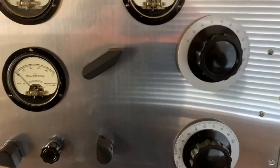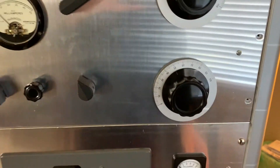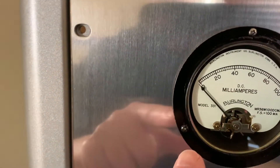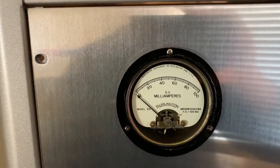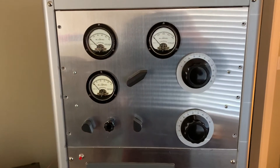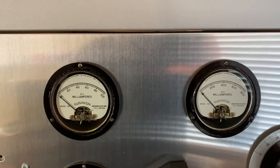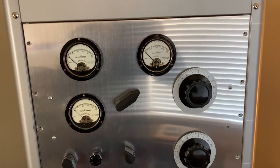I did correct the loading. Now on the first position on 40 it's somewhere close to the center of the range, which is the way I had it before. When I get on 75 and transmit I'm getting a full 400 watts, but the screen current is too high — it starts out on the left side of zero, so it's probably at least 40 mils. The max screen current I think is 60 mils, maybe 40 — I need to check the datasheet. The plate current at the dip is too low, and years ago when I used to load this thing I could get it above 330 mils. I don't know what's happened — it's probably the tank circuit with the clamp tube messing up the screen, but years ago I only ran 400 volts on the screen.